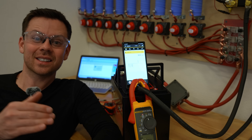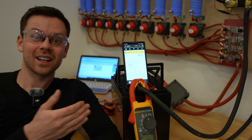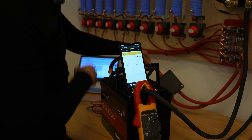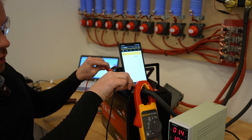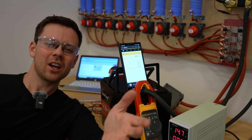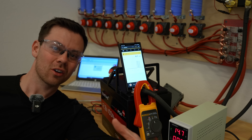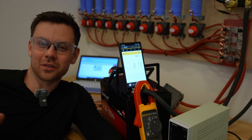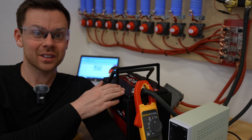I'm not sure if that was overcurrent protection or over temperature. We'll run the same test and see if it disconnects faster because the BMS is super hot right now. It will not turn back on — I think it's over temperature. Usually it's better if overcurrent protection happens before over temperature because you don't want to stress the hardware. The over temperature should be the last means of disconnect. So overcurrent protection works for a dead short, but anything less than that it's not really that safe. As always, add a fuse to these budget batteries.